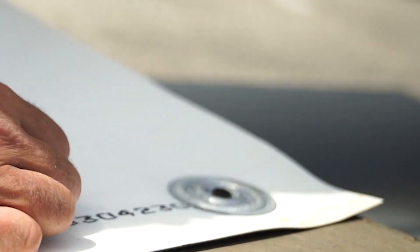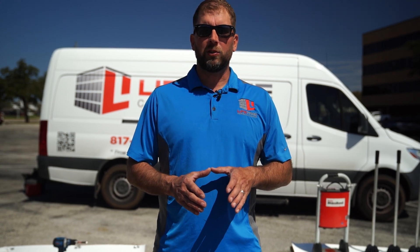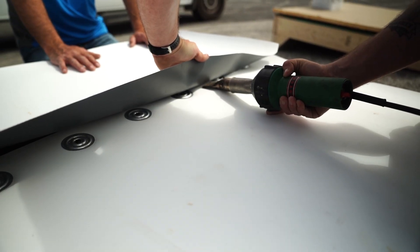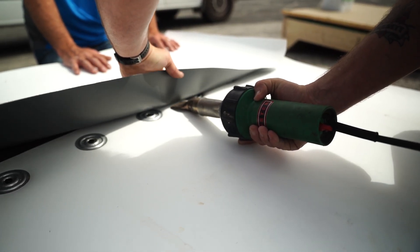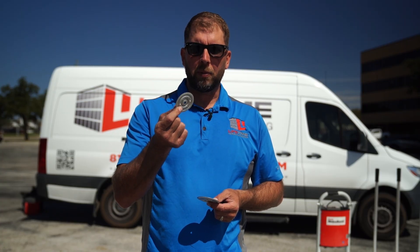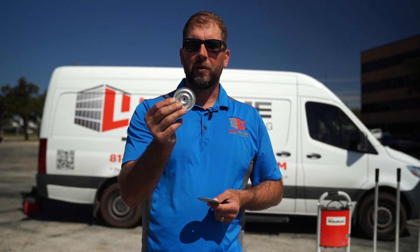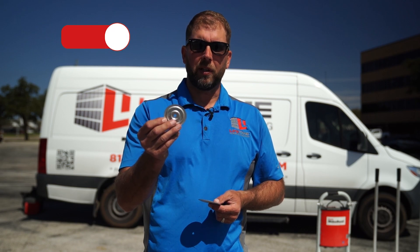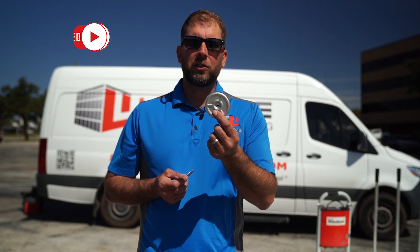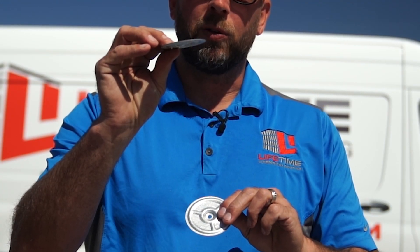Once we have that first row laid in, we stretch the membrane out and put another row of fasteners and plates to hold that tight. Once those fasteners and plates are in place, we roll the second roll of TPO out, spot weld the seam to hold it in place, then kick that roll out, stretch it, and put another row of fasteners and plates. This piranha plate or membrane plate is two and three-eighths inches in diameter and goes only on the seams and around penetrations like curbs and pitch pans. The insulation plate is a three-inch diameter galvanized plate strictly for holding your insulation boards in place — it doesn't have the little teeth that bite into the membrane.